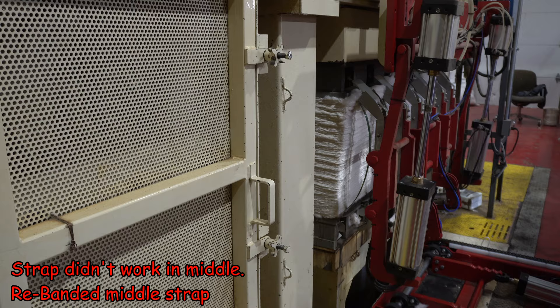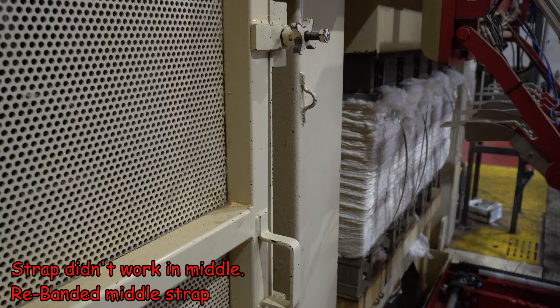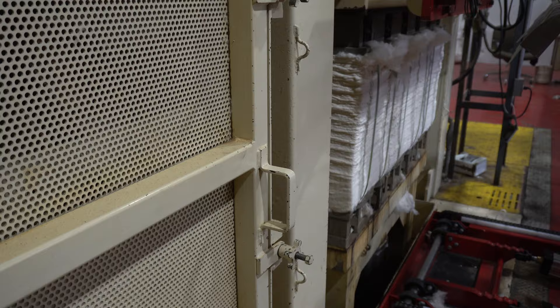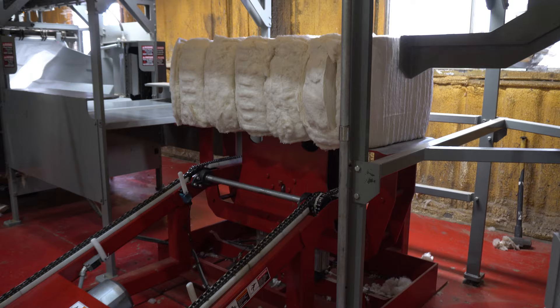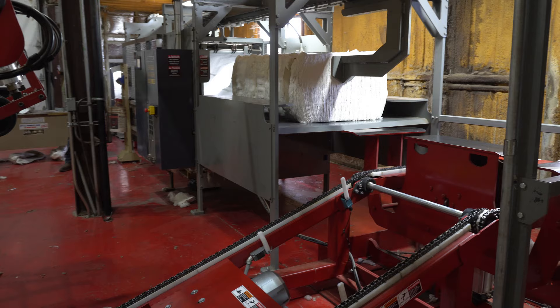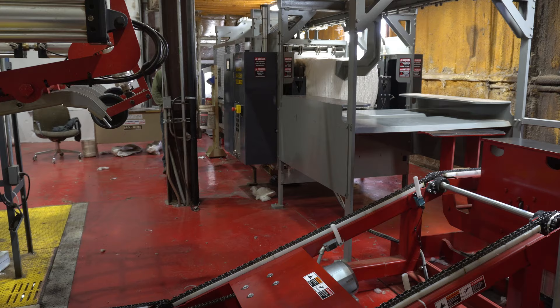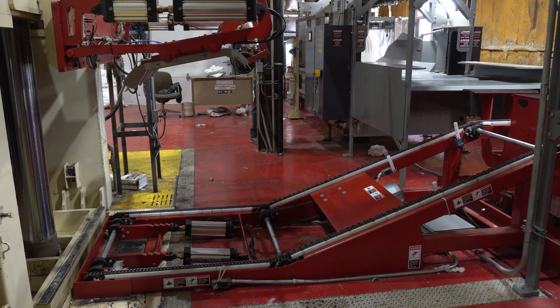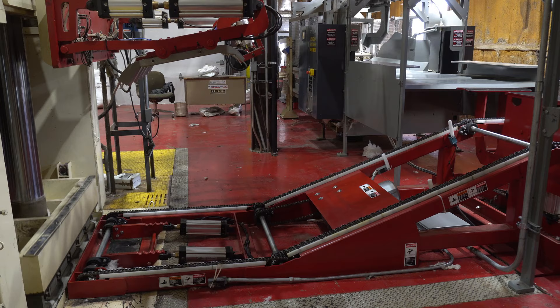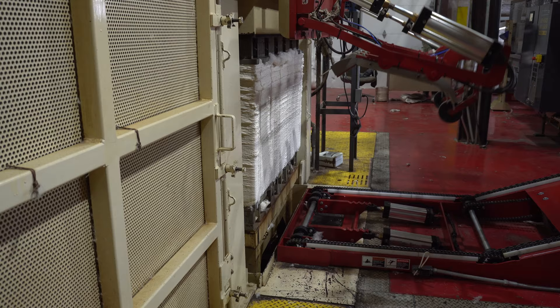Sometimes it bulges past the walls on the press machine, so he's pulling out any extra to keep it all running smoothly and uniform. As it compresses down, it automatically puts tension on that finished bale, and then it is ready for the final step in the ginning process: they're going to pull off a sample. At the same time it gets bagged and weighed right there, then marked with a number that is tracked from here all the way to where it is sold and used in production.